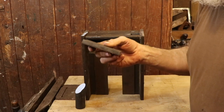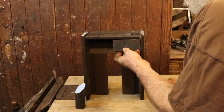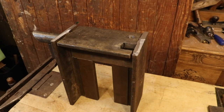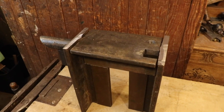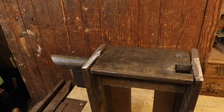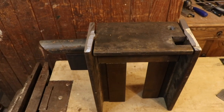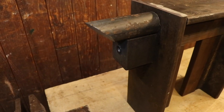I'll be reinforcing the two working edges of the anvil by welding in a heavy section of flat bar that's going to run the entire length of the anvil. The final step is going to be to weld all of this to an angle iron base so the whole anvil will become one unit and easy to move around. The horn here is being supported by a magnet — that's not part of the anvil.